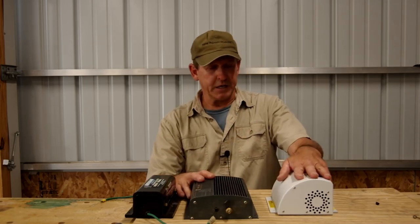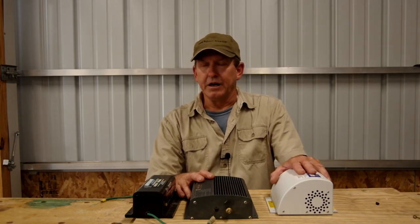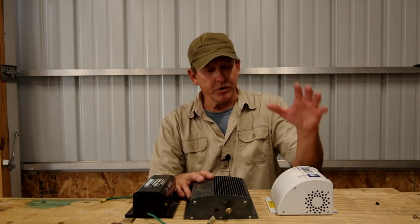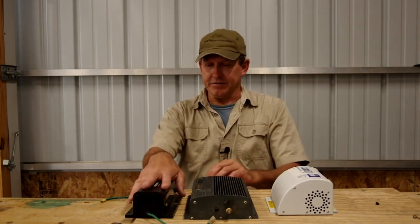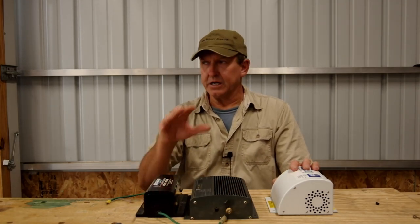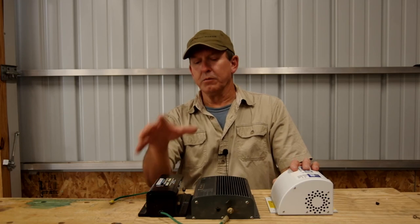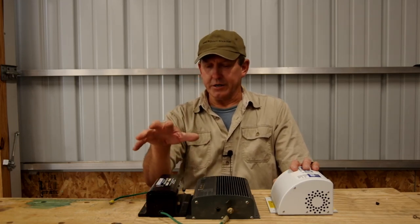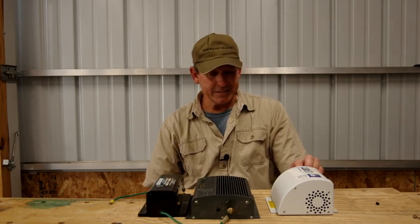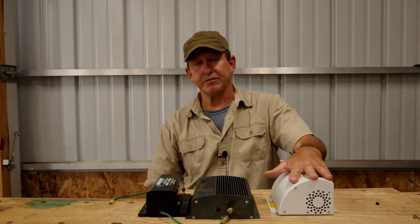So fail safe came around and now this is the standard. I can't emphasize enough that a fail-safe galvanic isolator is very important — because if an older device fails and breaks the AC safety ground between your boat and the dock, you would not know that. The shore power on your boat would still work, but you are ungrounded — a potentially very hazardous situation. Fail safe is the way to go, and to my knowledge right now there are only two companies manufacturing fail-safe isolators.